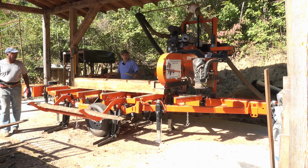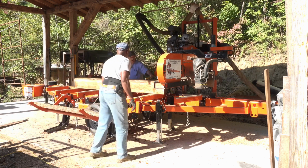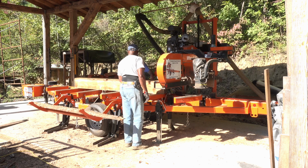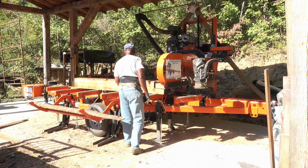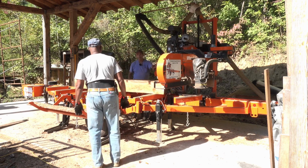See, if you go to your narrower spot, that's 7 inches. So you'll be able to cut off and still get a 6-inch board out, or a 7-inch board right there. There's a 6-inch board from that line. But if you cut a little bit more, you'll get a 6-inch board out of this top piece. That way you aren't wasting by cutting all the way down. Get every board you can get.